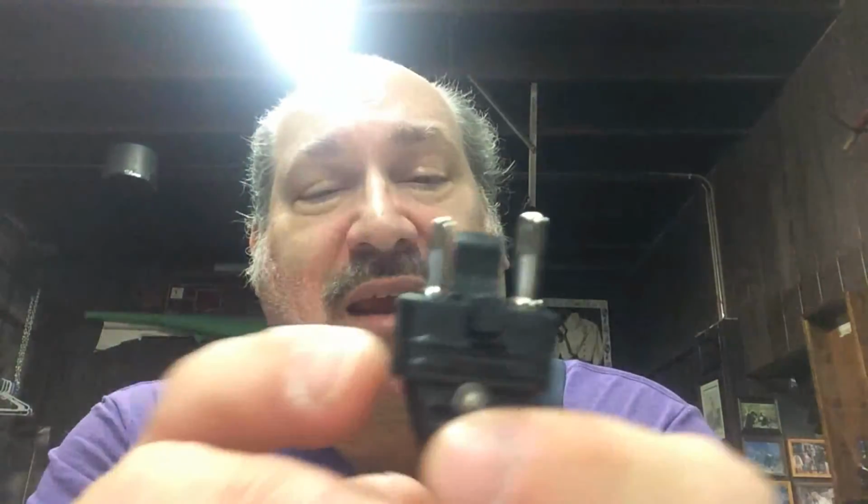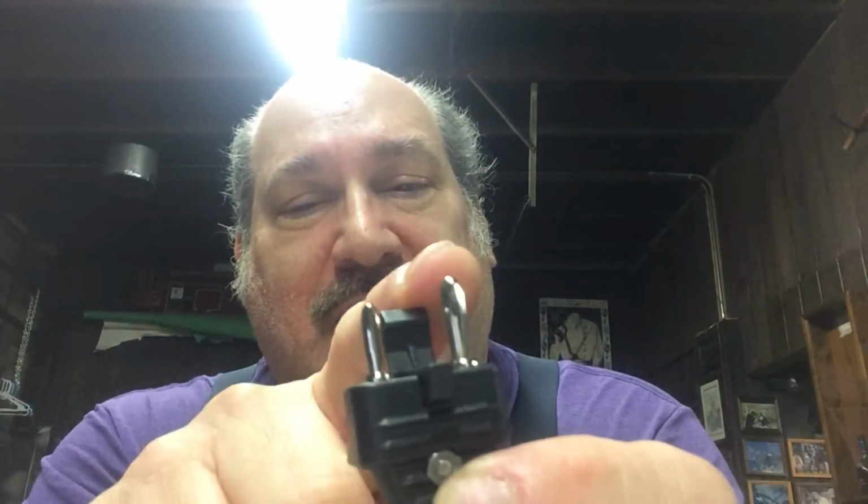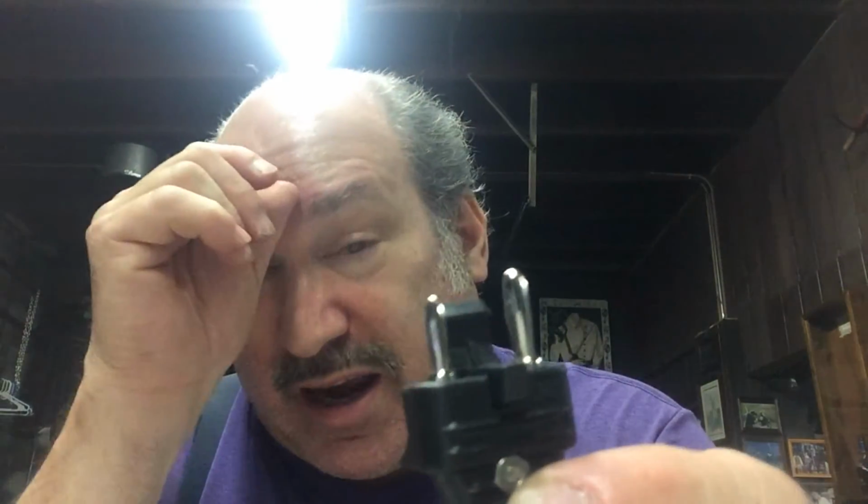It does matter where the pins are going to be put together. The B pin, which is the narrow one here, 3mm wide, always connects to the wire in foil and to one of the wires in épée. The C pin in foil is always the ground line, and the C pin is the ground line in épée as well.